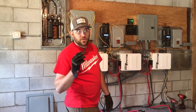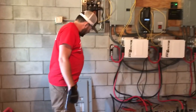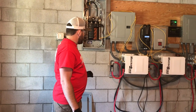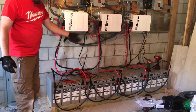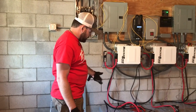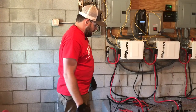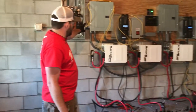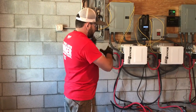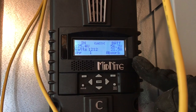We're here on the third day of this build — we had to come back because some materials came in. What we have left to do is hook in the network cables, put in the load lockout plate so that feedback into the service panel locks out the main power supply, and put the fuses into the blocks. These are Outback Nano Carbon 200 NC batteries — they come with a two-year manufacturer warranty. Pure lead carbon batteries from Outback are no longer on the market, so Nano Carbon is the next best thing. We've left space so that if another magnum is added later, they'll have 120-amp service available. The charging systems are going right now, filling up the battery bank with a good absorb charge.